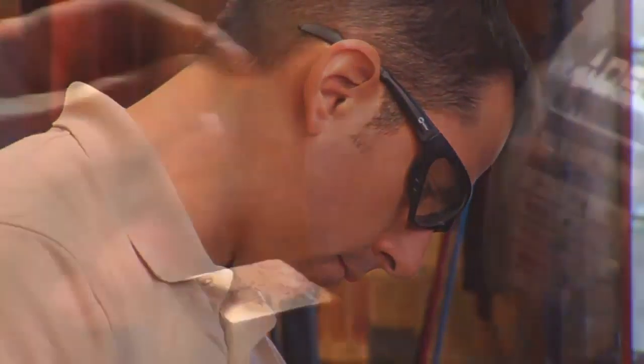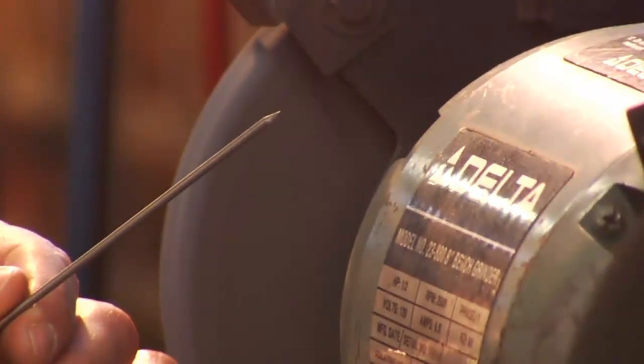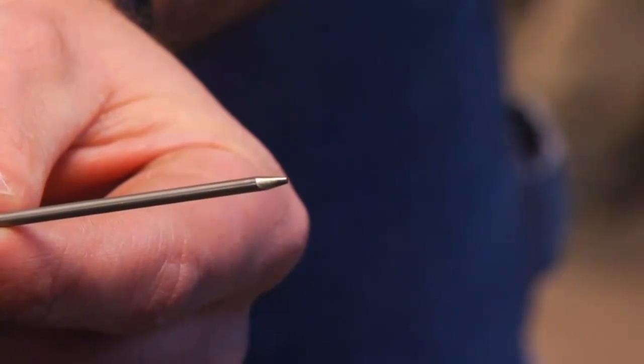This is how we would prepare the tungsten for welding mild steel, stainless, and chromoly. However, for aluminum, we would add one more step: take the sharpened tungsten and grind off the tip to create a flat spot or land. When complete, place the tungsten back into the torch with the ground end sticking out approximately 3/16ths to a quarter of an inch.